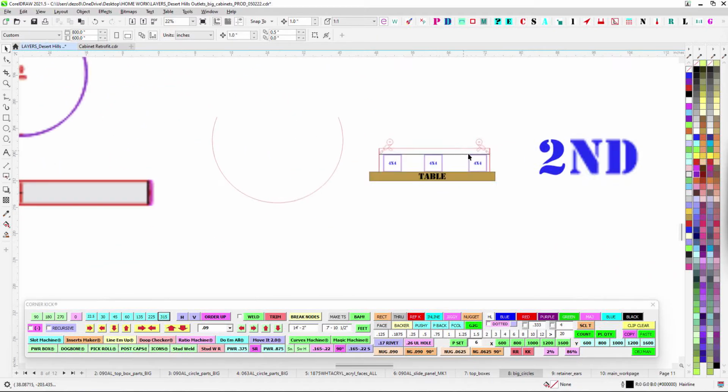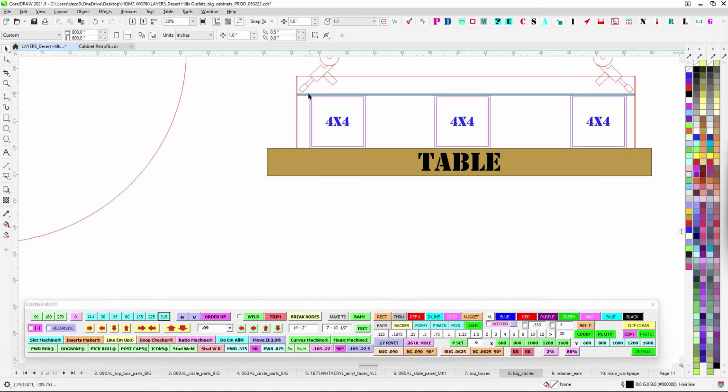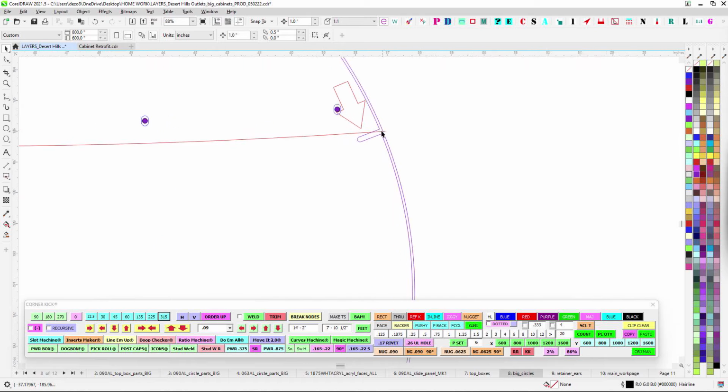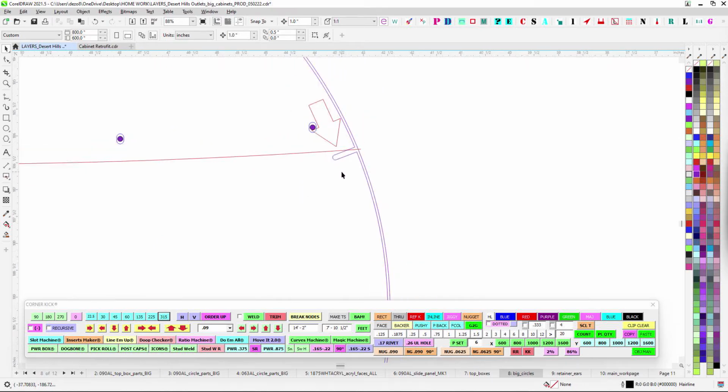Then this face, this return should be against your table, and then this should support the rest of the way. And then just go ahead and burn it all the way around, and then burn your seam, and then flip it back around and stitch up your seam. That's why I gave you 90s here to stitch up your seam. And those should just go right up in there like that. Nice, and that'll give you a place to tack it to and stuff.